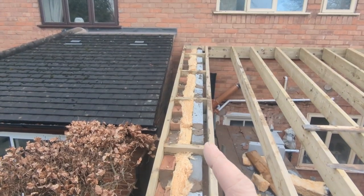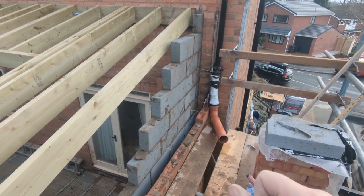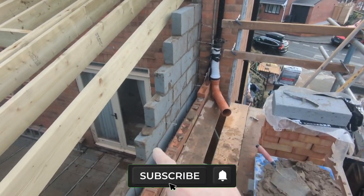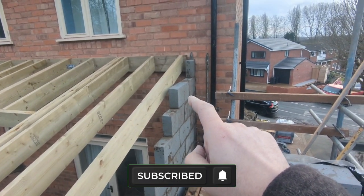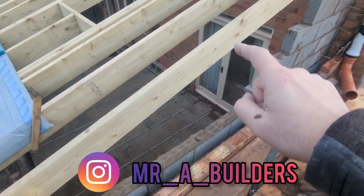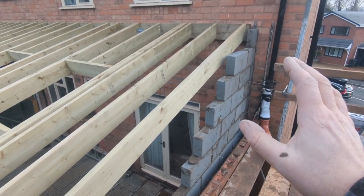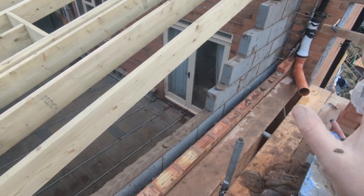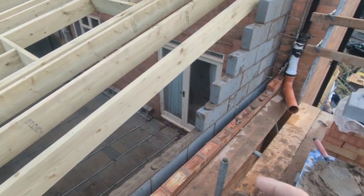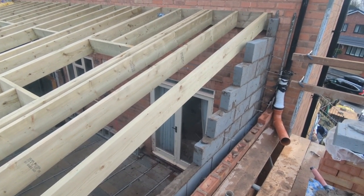I'll explain everything that we've done there, over there where I'm going now. Apologies if you can't hear me because of the wind - it's all picking up now, just getting into a bit of a precarious place. All I'm doing now - I've just racked that back, plumbed it all up internally, and I'm going to continue that. Come out another three or four and rack it back, just keep it below the top of the rafter. I'm not going to do any cuts just yet - I'll show you how we're going to do that in a second. That's basically all we're doing for now, racking back with the level. No point doing a line, it's just too short a run. It's a lot quicker just to get it up this way.